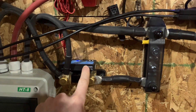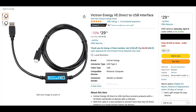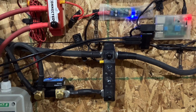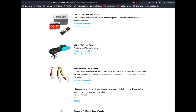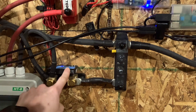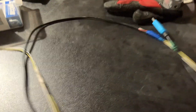What we need in order to connect the Raspberry Pi and the Smart Shunt is a VE Direct cable. It's going to plug in right here. You can buy the VE Direct cable from Amazon for about 30 bucks. Or I ended up seeing on the Off-Grid Garage where Andy gave the cheaper cables to buy, the cheaper parts to buy, and the pinouts to be able to make your own cable for half the cost. I spent about $15 making my own VE Direct cable to go from the Smart Shunt over to the USB on the Raspberry Pi. Here's what my own cable looked like.